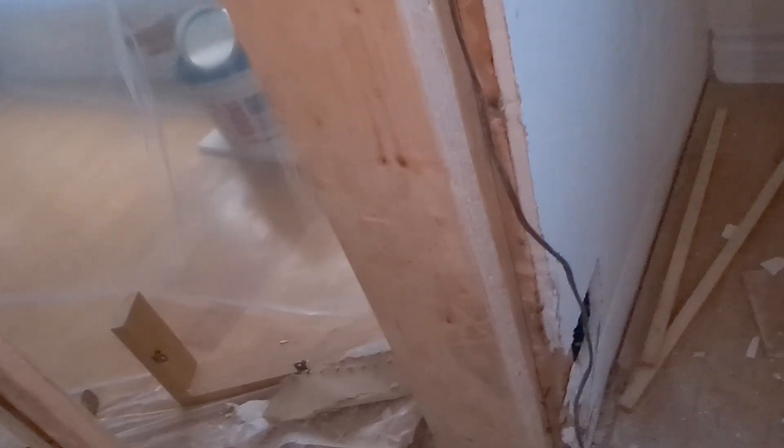Sometimes that happens. What you usually do is put shims — because of the ceiling joists, they're not even, so that's what happened. If you encounter that, you're just going to put shims like that. Down here, make sure you add it on the bottom plate.